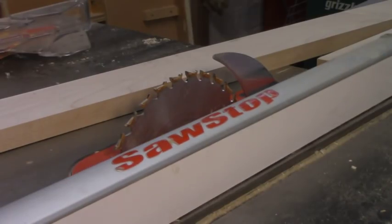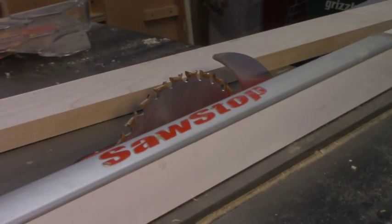Now that we've talked about what happened and what I would have done differently, I'd like to talk about what I'm going to do going forward. This is the exact setup I was using when I hurt myself. And if you're paying attention, you might notice one thing that really is a problem here — no blade guard. I just have the bare blade. I am using the riving knife to help with kickback, but the blade itself is totally exposed. My saw did come with a blade guard, and it's not very difficult to install, so let's take a look.